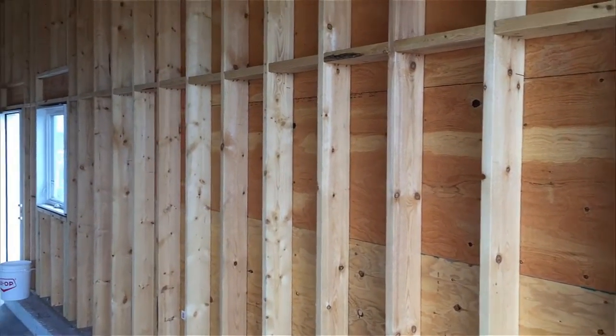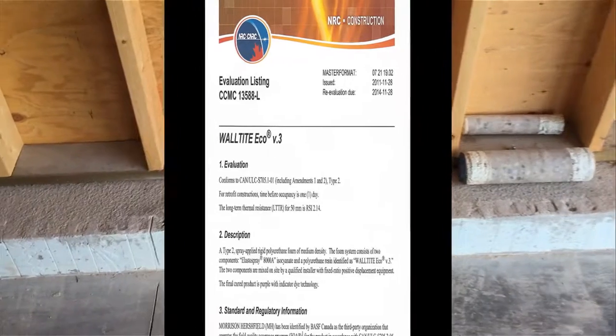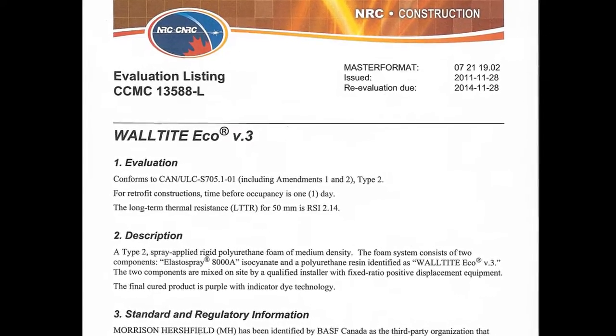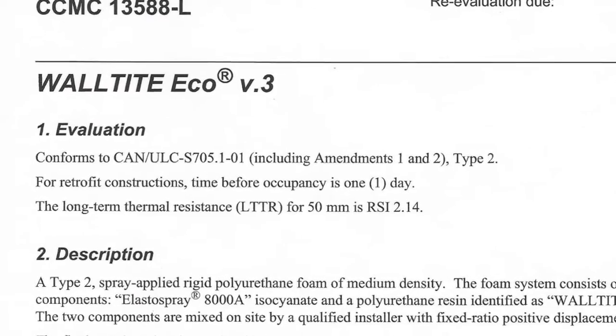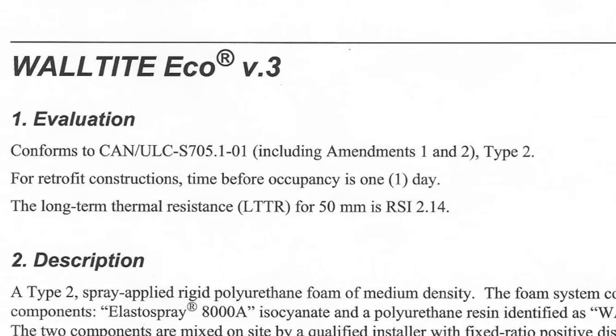As far as regulations are concerned in Canada, the Unified National Building Code of Canada is the law of the land. It has a ULC requirement, which stands for Underwriters Laboratory of Canada. It is the minimum standard that a CCMC-registered foam has to meet, along with the third-party certification program and all of the regulations that go with it. No foam going into a structure under the NBC — National Building Code of Canada — can fail to meet that standard. You can't use a non-rated foam. The provinces have to adopt that as the minimum standard with no exceptions. If you're not spraying a CCMC and ULC certified foam, you're digging it out at some point.